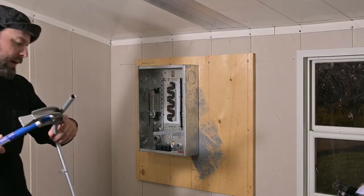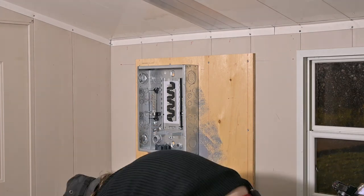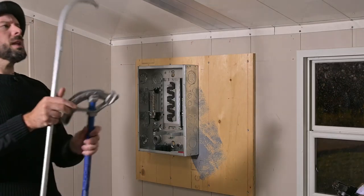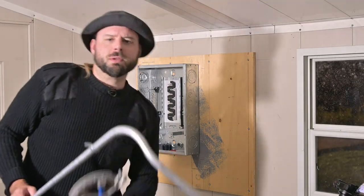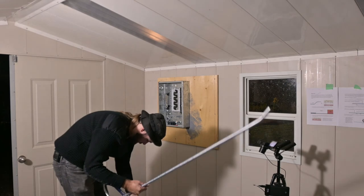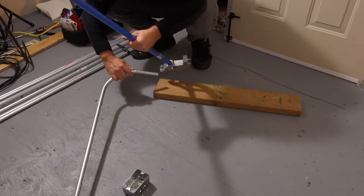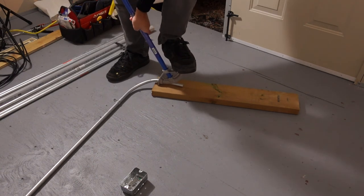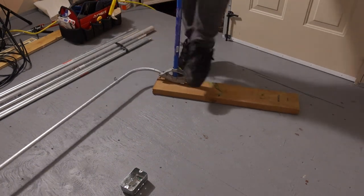Can I even put this in the bender that way? That's totally going to bend it the wrong way — that will bend it the right way. So we've got to get it down on the ground. 30 degree bend straight up. Now, on our second mark — that is not going to be possible like that. I may have created a problem for myself, because I've got to bend this back this way. It might be too close together to do this kind of trickery. It's done like this. We're going to need something to put it up on. It's so easy to mess up this kind of thing, because you've got to look at it upside down and backwards.